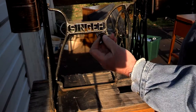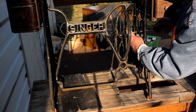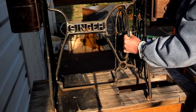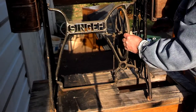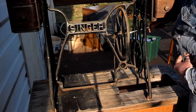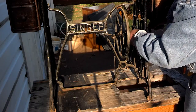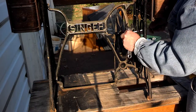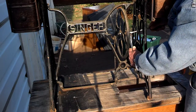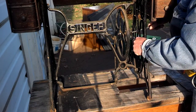Give yourself plenty of room, take your screwdriver, and basically screw it in. You don't want it so snug that it won't move — you want it to hold it in place but without any play. At these two pivot points, put oil too, just a drop or two. If you go too much, you can wipe it off with a rag or paper towel. When tightening down, hold your screw, get it snug, and then take your wrench and tighten the nut down without letting the screw go.